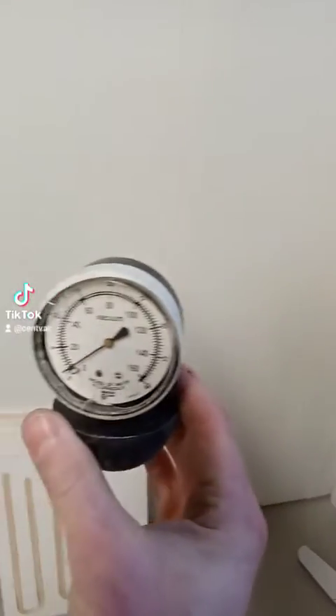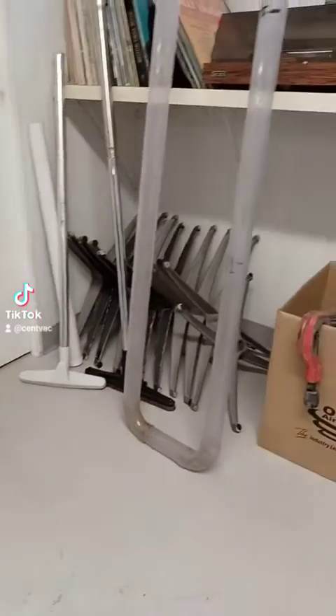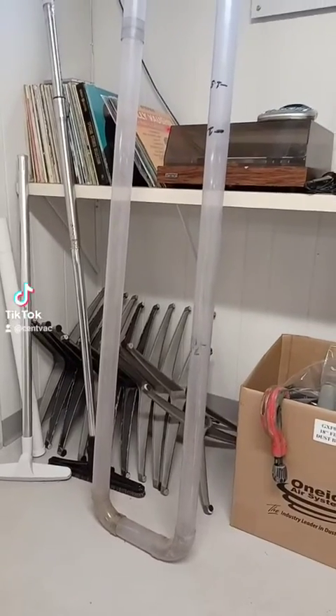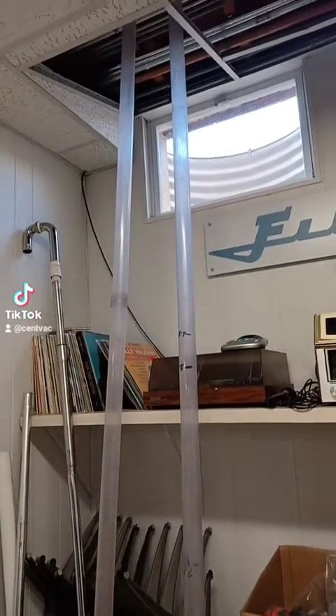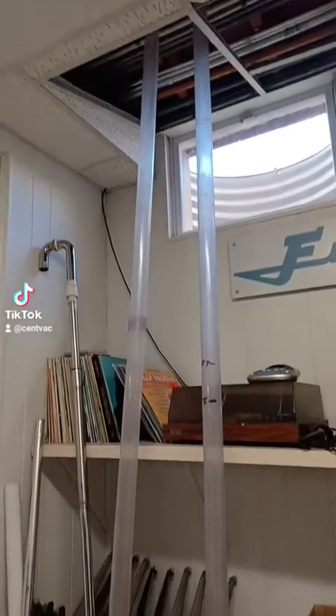The whole concept of water lift comes from actually lifting a column of water up a U-shaped tube. So you can make a giant water lift gauge — just a U-shaped clear tube — but if you want to measure 100 inches of water lift, that thing has got to be 100 inches tall.